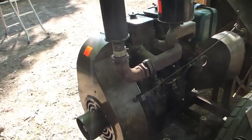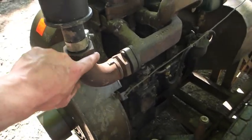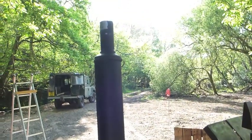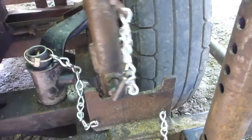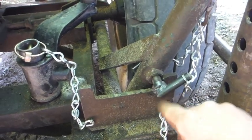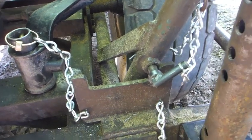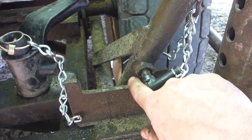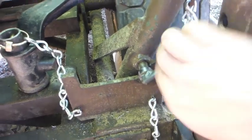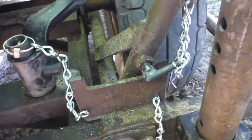The exhaust on these machines is normally an industrial pepper pot silencer that comes straight out here and fills your face with fumes as you're sawing. So I've put this angle on and fitted a tractor exhaust which takes the fumes above your head and makes it much quieter to operate — the noise is coming out above your ears, not below them. The locking pins to limit the table swing were, like on most saws, really badly worn — just drilled straight through the tube and the holes had elongated and torn out of shape. So I filed the hole back round and central, inserted a one-inch piece of steel bar with a hole down the middle, and now there are new pins which can be removed if required, and they mean the table movement is properly controlled.